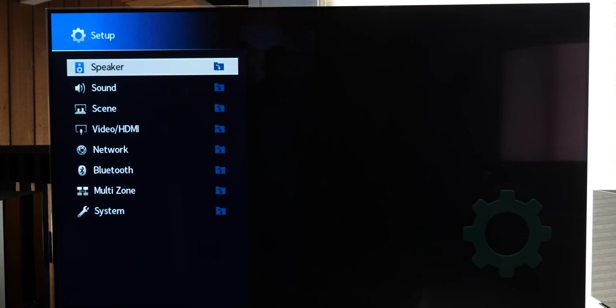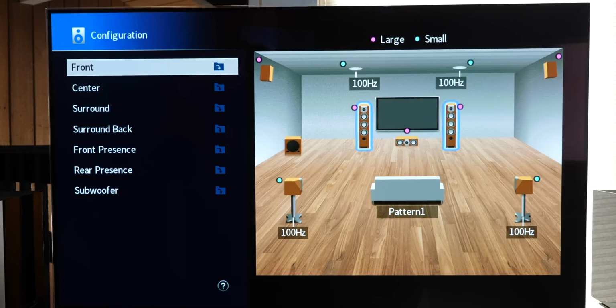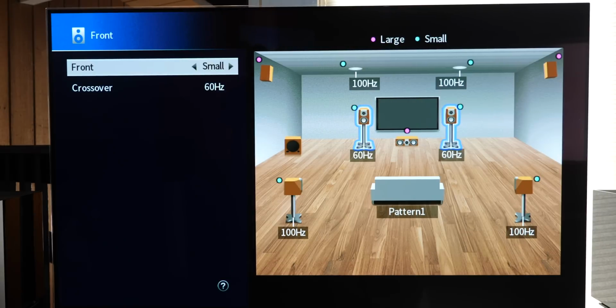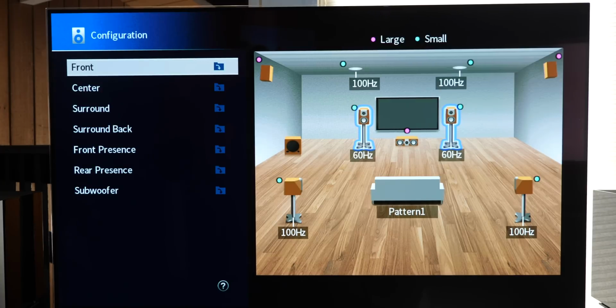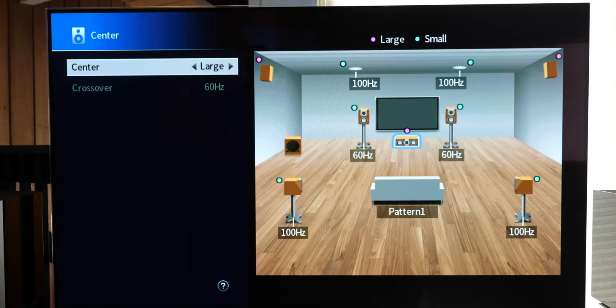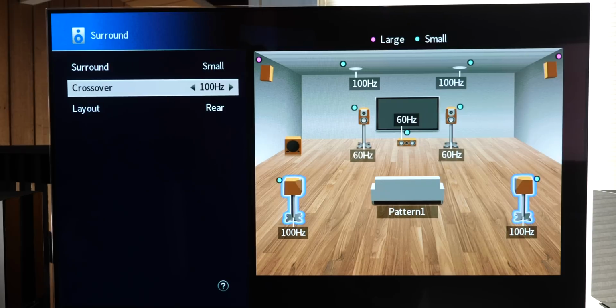Now we need to go into setup, speaker, and then configuration. Now here's where we want to change the large speakers to small speakers. Now for the front stage, I know these speakers well. I'm going to change these to 60 Hertz. And I know you guys are going to be like, no, it's got to be 80, it's got to be 80, blah, blah, blah. But I made a video about 80 Hertz crossover and I'll link that in the description and with the card up top so you guys know why I'm not sticking with 80.